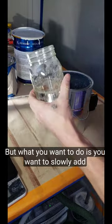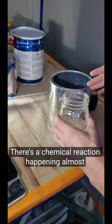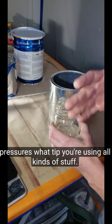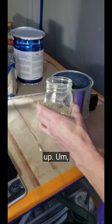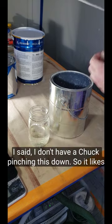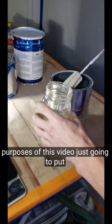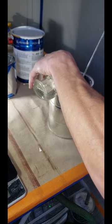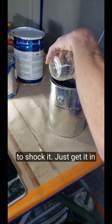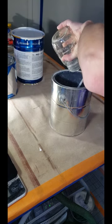So now what you want to do is slowly add this in while mixing. Because if you just dump it in and then mix it, you're shocking this material — there's a chemical reaction happening almost immediately. You don't want that. It can change the consistency and viscosity of your material, and then that's going to affect your pressures, what tip you're using, all kinds of stuff. So it's better to just add a little, mix it up. Since I'm doing this alone, I'm just going to slowly add while I have the mixer running. So I'm going to put it in there slowly and mix it. You just want the material moving while you're pouring this stuff in slowly — you don't want to shock it. Alright, so it's all in.